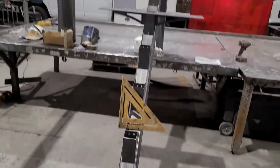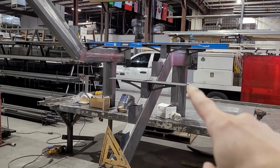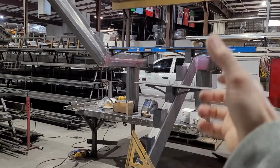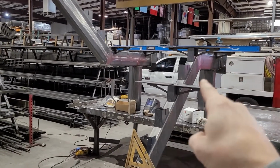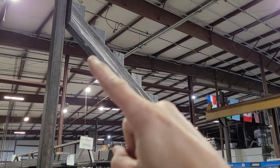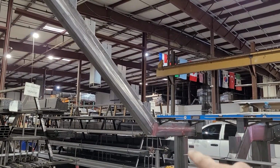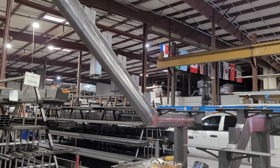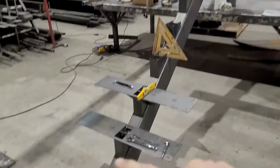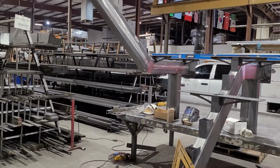Just remember, easiest way to set this thing up is to put a little blocking or something on the wall, figure out your landing height, and then you can just pick this one end up, set it on your blocking, run your screws in this other end as well. It'll sit up on your top floor there, but if you put a little blocking in the front of the wall right there, it'll just set right down on that blocking. And then once you have these in the air and your landing is nice and level, just bolt your steps on, and you got your beautiful new stair. Thanks, guys.